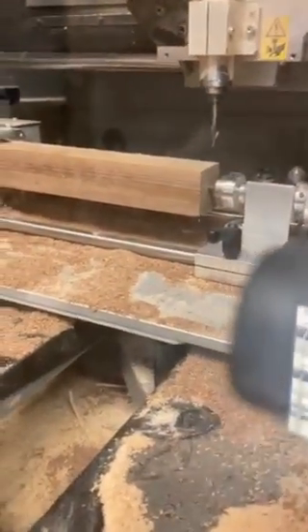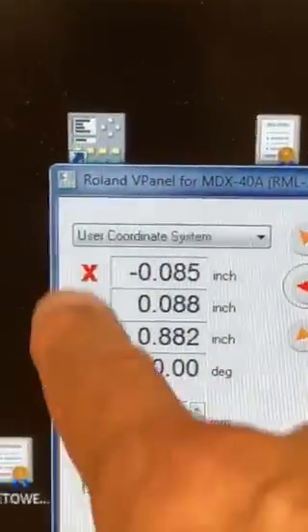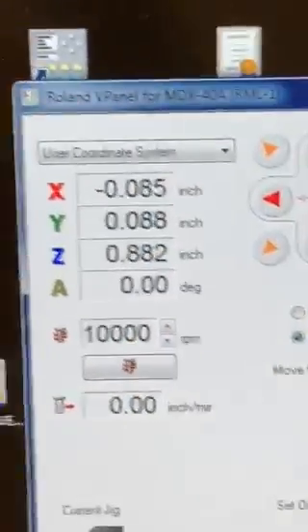Let's give this a try. I'm going to turn it down to low speed and eye it up. Actually, that's pretty darn close right there. It needs to come just a little bit forward. For the sake of time, let's say we're happy right there — that is going to be our origin. We need to note though that we have not yet told the machine that that's our origin; we're close but not quite confirmed.